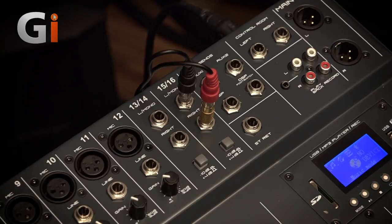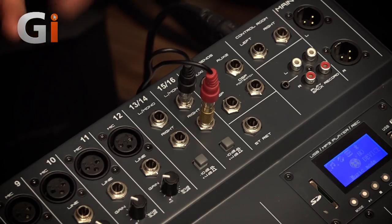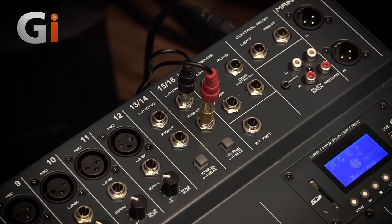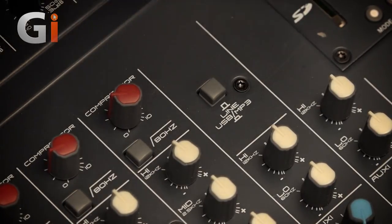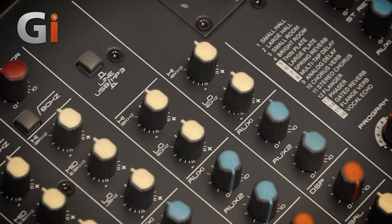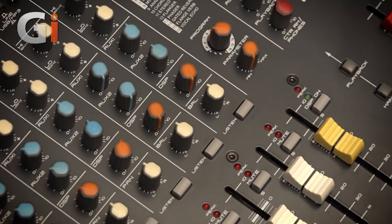Moving along, channels 13 to 16 are two stereo channels on line level. You can put in a mono source like a feed from a guitar modeler, or run stereo. Switchable minus 10 or plus 4 — studio level or consumer product level like a CD player. Channels 13 and 14 can be switched either from the jack inputs or to get the feed from the built-in Bluetooth MP3 player and recorder system — a simple switch. The stereo channels have a simple two-band EQ because if it's coming in on line, it's probably already EQ'd. Otherwise they have the same two auxes, DSP sends, pans, faders, listen, and mute switching — identical to the main channels.